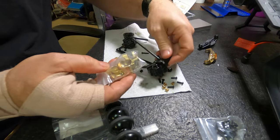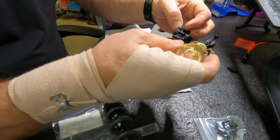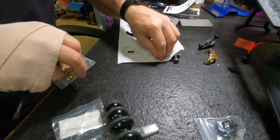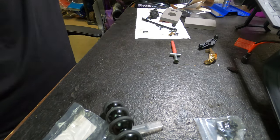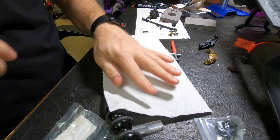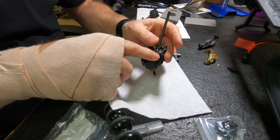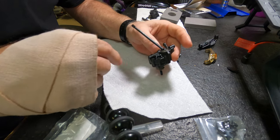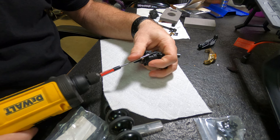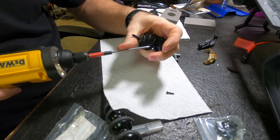Basically we're going to replace that with that, this with this. It's going to get real crowded in here when I get all them screws out of that portal cover. You've got two screws on the front and six on the back, plus three that are holding the bearing in. We'll take the screws out of the portal first — I believe they're all a 2.0. We'll lay them down here according to where we take them out at.